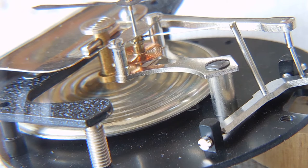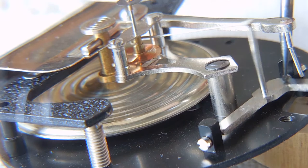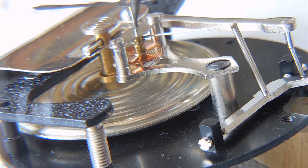Here's a lever arm - a small motion at one end causes a big motion at the other end. Down below there's an anvil and it presses on a rotating pinion, which also has a lever arm on it, so the lever arm moves back and forth. The pole is connected to a piece of thread, which goes to a chain, and the chain wraps around an axle. As the chain pulls, the axle rotates and the needle shows the new pressure.